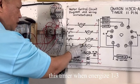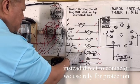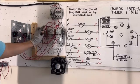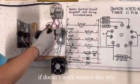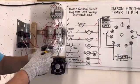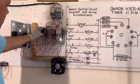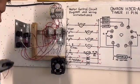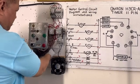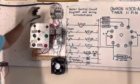Now plug in. When the timer is energized through the relay — instead of connecting directly, we routed through a relay for protection. This is protection for the timer's internal contact so it lasts longer. If the relay fails, just remove and replace it. You can see the contact becomes dark — the load is small, but the contactor coil is big. The relay is protection for the timer because the timer is expensive.